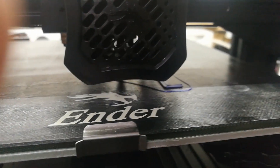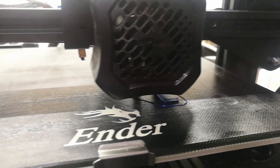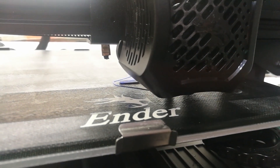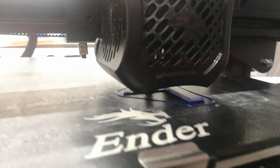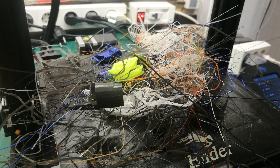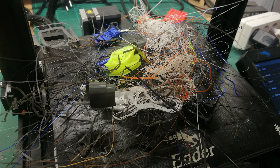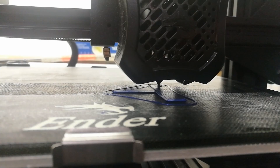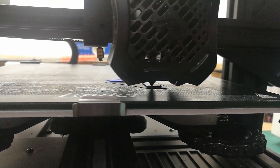It's been close to a month — actually a few weeks — since I've had the printer. There's been quite a steep learning curve, to be honest. I was expecting to get up and going a lot quicker, or at least to get successes a lot faster. However, there were quite a lot of failures — some spectacular, some fun, some downright annoying. Most of it has to do with bed leveling and bed adhesion. This is very important. The first layer is without a doubt the most important, and once you get that one down properly, usually after that everything is generally smooth sailing.